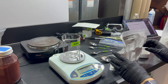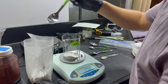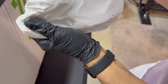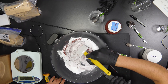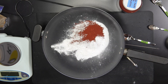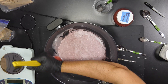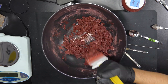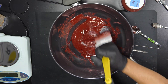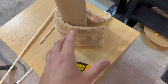The very first step is measuring out each of the ingredients — I start by measuring out the sorbitol, then add the red iron oxide, and then measure out the two different types of potassium nitrate. Potassium nitrate tends to clump up when exposed to moisture, so before mixing I add it to a Ziploc bag to mash it up and break up any large clumps. I'll work out remaining small clumps with a spatula when heating. I add all the chemicals to a pan on a hot plate — I'm personally using a wok, which works well because its edges sit over the cooktop so if any propellant spills, it won't fall onto the heating element. I mix for around five minutes without heat to ensure everything is thoroughly combined, then turn on the cooktop. It's important to keep stirring and avoid letting the mixture sit in one spot, which can cause uneven heating. When the propellant reaches 250°F, it's time to take it off the cooktop and pour it into the liner.